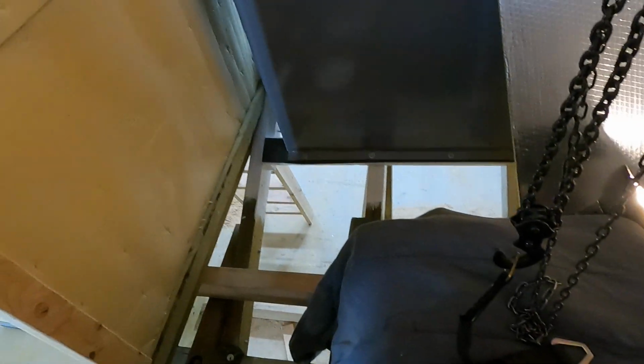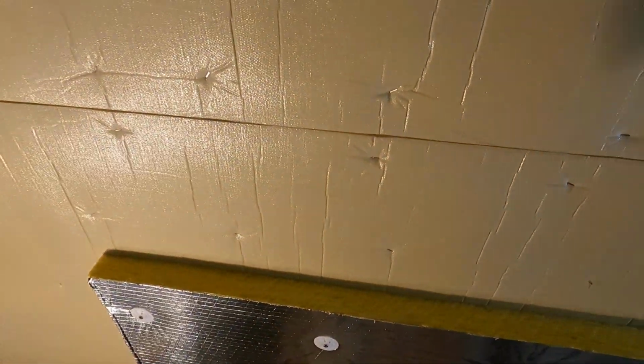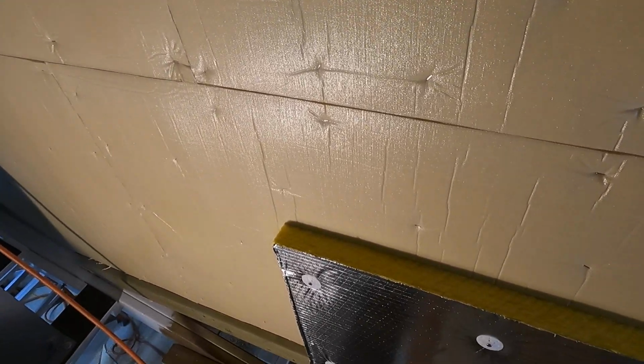Actually, I got a couple feet up here too, but I'll probably put the water system up here, because that's closer where the water is. Put the pumps and manifolds, valves for the water system. Probably the water maker will go here. Excuse me, can have a pickup through hole down there. But anyway, so what I need to do is I'm going to need to get a layer of plywood over at least some of this to mount things on. And I think I'll just probably run a couple of 2x across the length here, and then maybe put a couple of supports in the middle to keep it from flopping around too much. But this will be just about flush covered with plywood, most of this wall anyway.